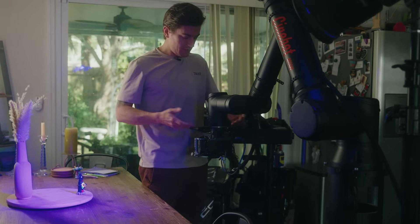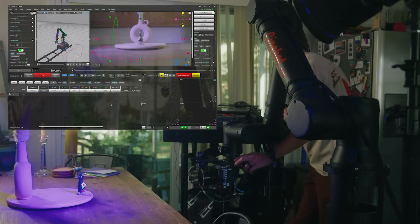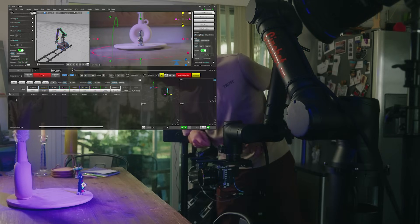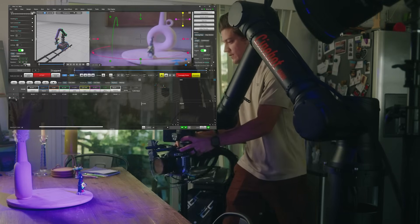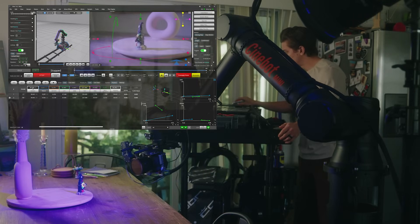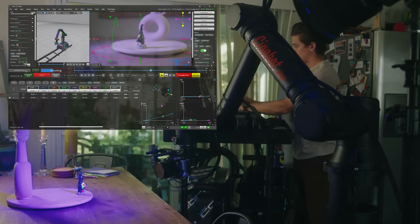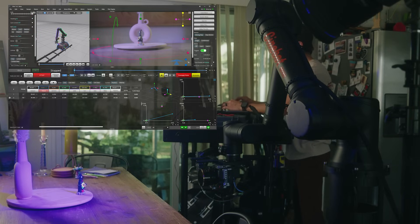Alright, let's line up our first shot. We'll push the button, light turns green, we're free to move the camera. We will just kind of line up our composition here. I will adjust focus — you can do this with the hand unit if you want, or you can do it directly inside of Flare. We will store that as position one. We'll add another line, move the robot to another position over here, rack focus. The focus is going to tell Flare where the target is. So now if we back-run this move, it should have a nice move — it stays locked onto our subject. And that's how easy it was. And if the horizon is ever not level, all you have to do is go to roll level and it will automatically level the horizon for you.